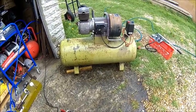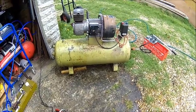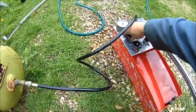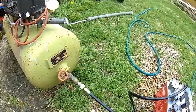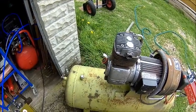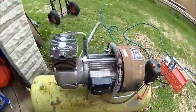Never do it with air — always do it with water. And if the compressor was sitting for a long time, check it, because if this thing goes pop it makes a mess. It's now half an hour later. We release the pressure, take the plug out, open the drain cock, and drain the water. Then we blow it through with air to make sure it's dry inside. We inspect it for any cracks. It didn't lose pressure — it only leaked on the outlet valve, and we're gonna fix that anyway.